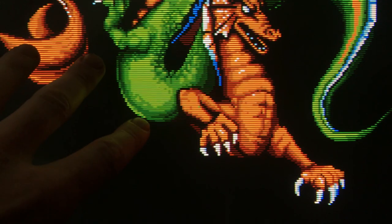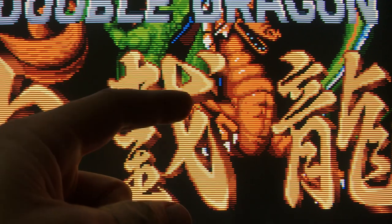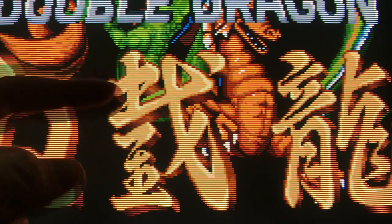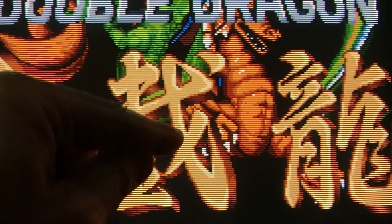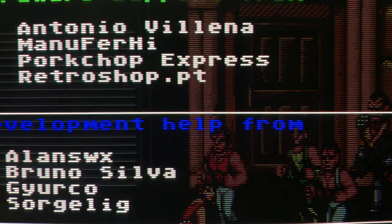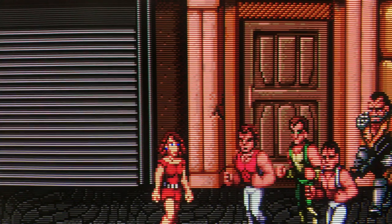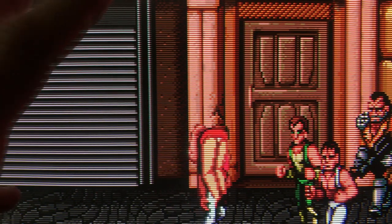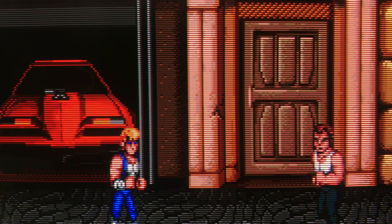That 1000-line one is actually too sharp. So this is actually the better-looking one on video — it looks more like a 700-line on camera, but in person the scan lines aren't as thick as the colored lines. On that other VGA monitor I have, the scan lines are just as thick as the colored lines and it's just too much. So for me this is the perfect balance where the scan lines are just a little bit thinner than the actual color lines of the visual image.